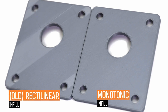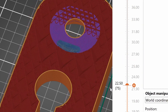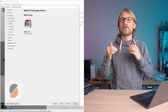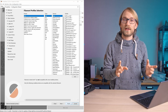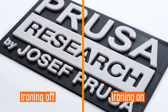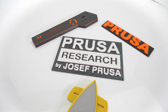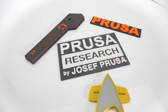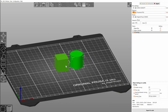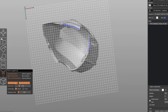If 3D printing is more your thing, it's been an exciting month of announcements from Prusa. The latest version of their Prusa Slicer software includes a bunch of practical enhancements and is more broadly compatible with whatever brand of 3D printer you're using. Thomas Sanladerer reviews the new software and shows you step-by-step how to set it up on any 3D printer. My favorite new feature is called Ironing — it does a heated pass over the topmost layers of your print, smoothing out rough artifacts. I've been using it for a few weeks now, and though it does add to your total print time, it makes a noticeable difference. They've also added a new option for painting on where you want support material and where you don't.